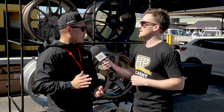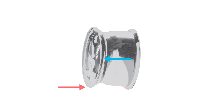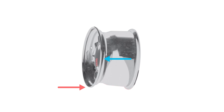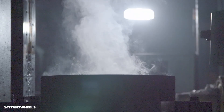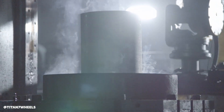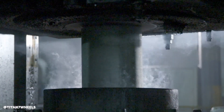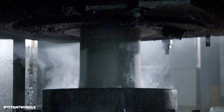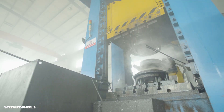You have to make sure that when you're going through a corner — like at World Time Attack — if your wheel deflects multiple degrees, even though it's light, you go backwards. So we have to make sure within the design and manufacturing process that you have a wheel that doesn't deflect much and is very safe. In our case, we use a completely forged wheel, so you have that inherent improved properties of the aluminum introduced by forging.